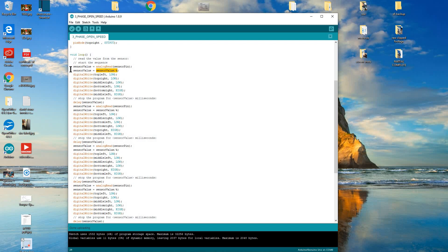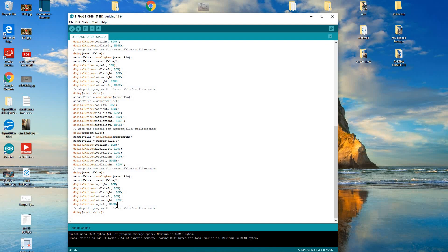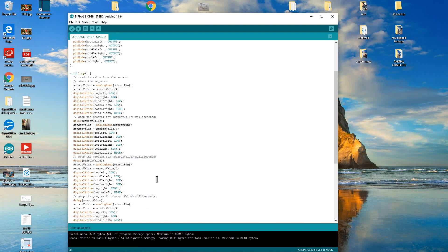All this is doing is switching some pins up and down. If you're going to try this at home, make sure you put all the lows first — because it runs sequentially, it'll shut all the pins off before making some high, so you won't get any crossovers. You don't want middle left and middle right both high at the same time, otherwise that could cause a short. So put your high ones last. You've got your six steps: bottom right high, middle left high — and if you go back to the other video with the flashing lights and the piano music, this follows that sequence. To reverse the motor, just run the reverse sequence.